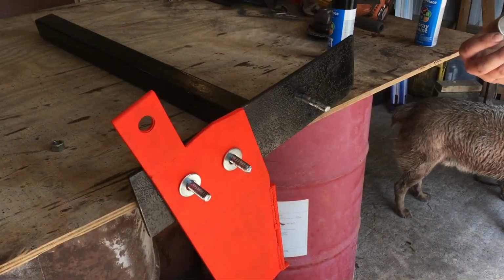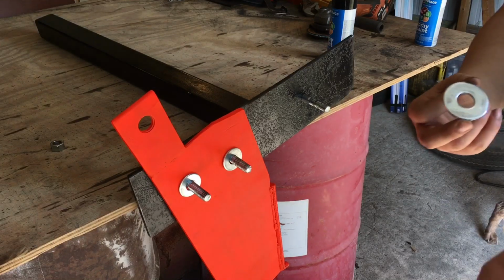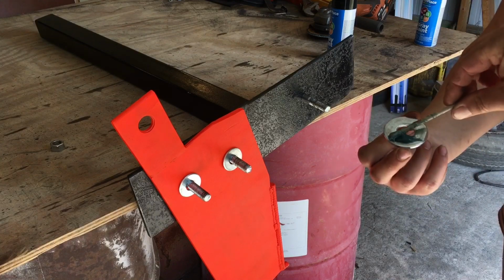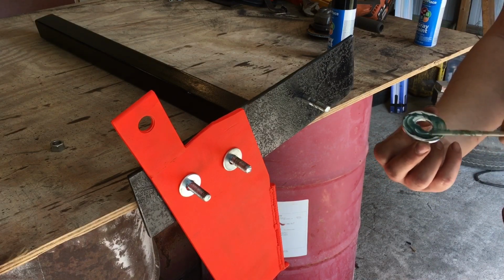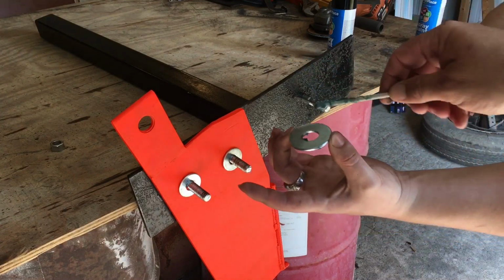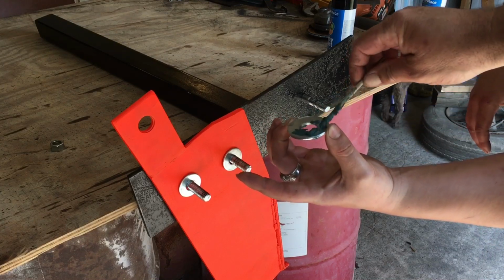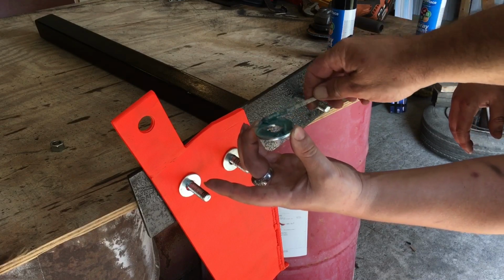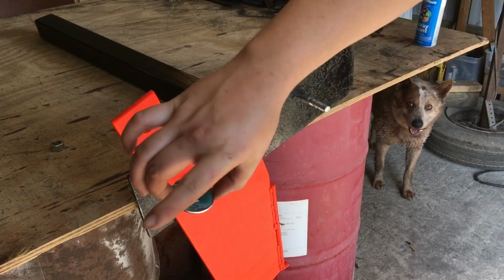We're starting to assemble it now, son, and this is going on the moving jaw side. Like I told you earlier, the washers are going to create the contact point. So hold it over there. You got to get further over. Yep. So we grease these up. That way it's got a small contact patch, and no more than they move, that'll probably last about forever.